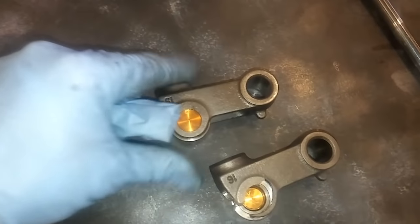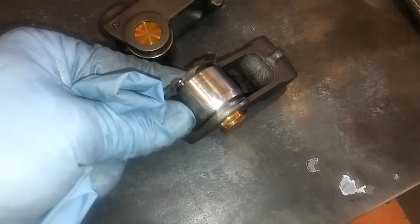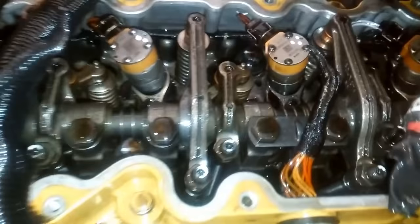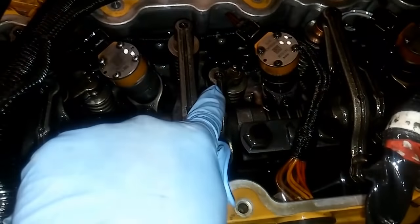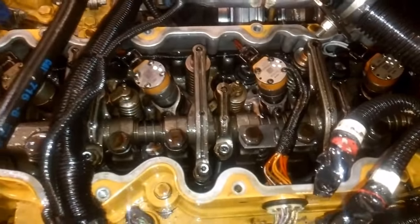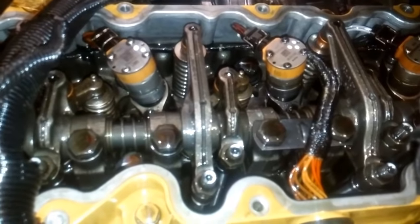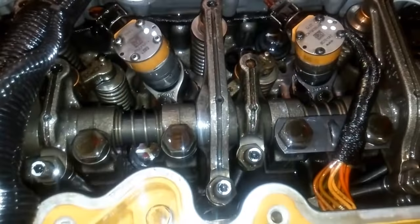Your oil filter housing, and your oil cooler is behind the oil filter housing. Now these are the lifters — that is a good lifter, and here you have a failed lifter. This is a somewhat common cause of failure on the C7s; it can damage the push rods. That is a normal looking push rod on the right. And here's your overhead: you have your injectors — HEUI injectors — which can be removed without removing the valve train. It's a dual valve setup on the intake and a single valve on the exhaust.